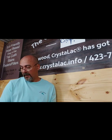Now that's a dry time and it's not ready for full use yet. You can't throw your car keys on it. You can't set your coffee cup on it yet, or at this time of year, your sweet iced tea. So when can you do that? Well, cure time is a totally different thing. Cure time is the amount of time that it takes for a particular product to reach its full potential, its full hardness, its full water resistance, all those things that these products are designed for.